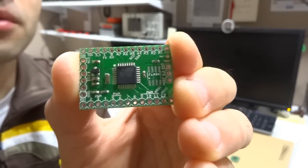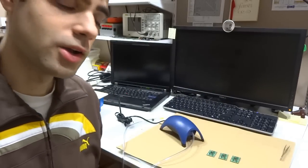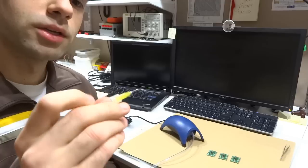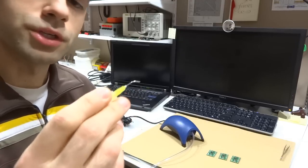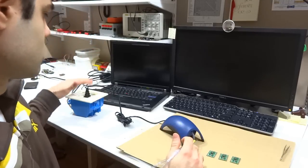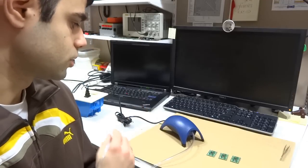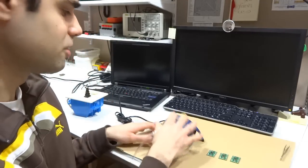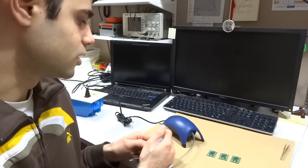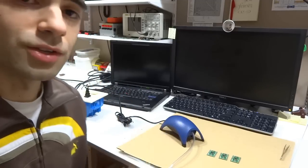I like to let it cool down for about a minute before pulling them out. Here's a finished PCB — all the components seem to be pretty well aligned and I'm pretty satisfied with the outcome. I hope you enjoyed this video and get inspired to build a tool similar to this to help with hand placement of SMD components. It'll be much faster than tweezers and a microscope. This whole setup probably cost me around $20 for the pump, the hose, and the switched outlet. It'll only take about an hour to modify the pump and another half hour to build the junction box — or you can plug directly without building that, bringing cost down to around $15. Thank you for watching, please subscribe to get updates when I post new videos, and check out my blog at lowpowerlab.com.